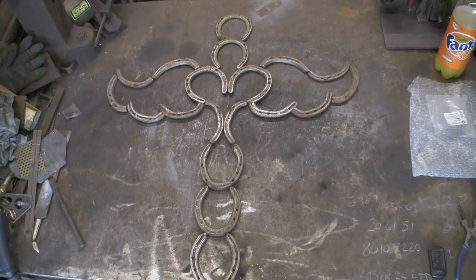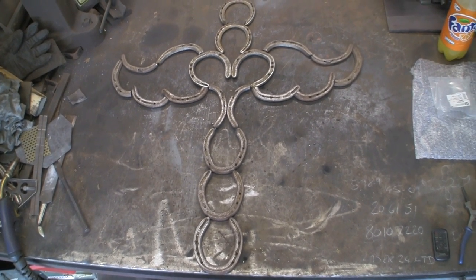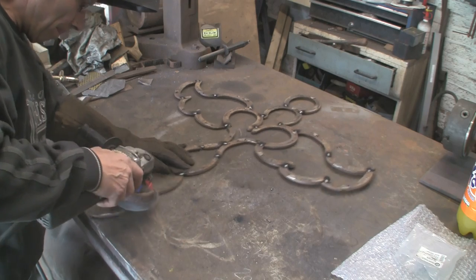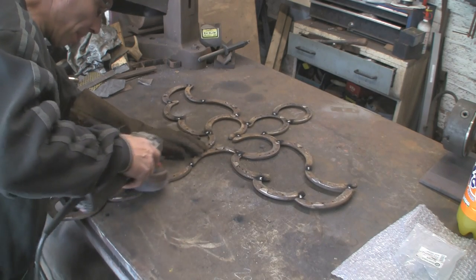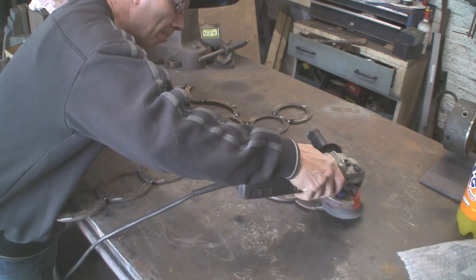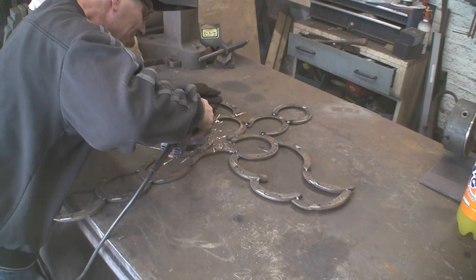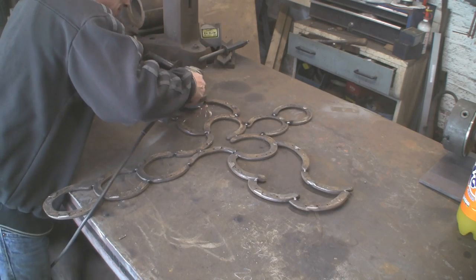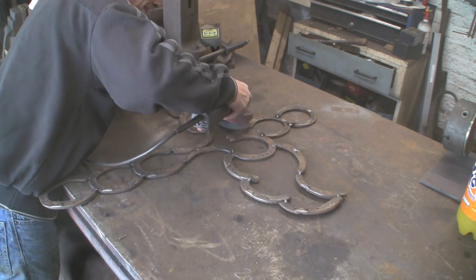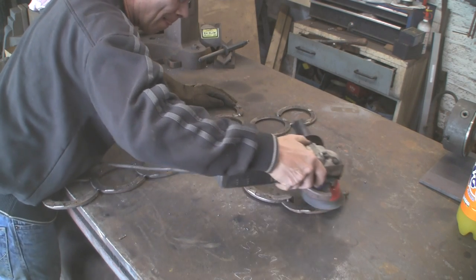I've tacked it all up just on the back, put a few tacks. That's sort of it — not quite sure about the wings bit, but not too bad. What I'm going to do is give the welds, or the areas where I want to weld, a bit of a wire brush, because these shoes have literally just come off horses and been chucked in the scrap. They're covered in manure, mud, all sorts of unsavoury stuff. So I'm just going to get the worst of it off so my welds will be a little bit better — I'm not trying to weld through crud. Then we'll give it a blast.